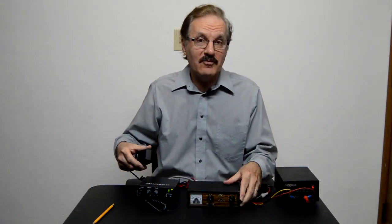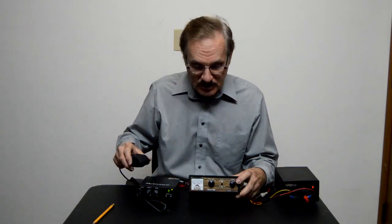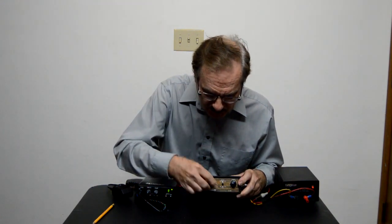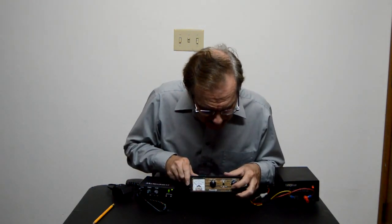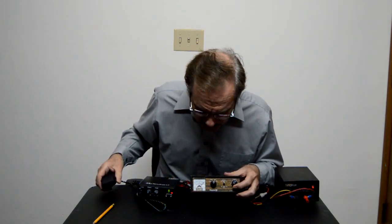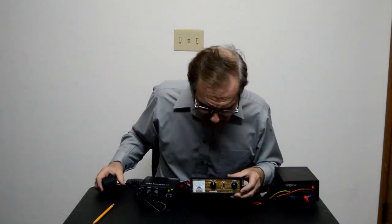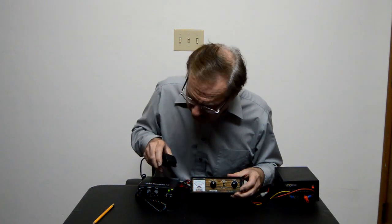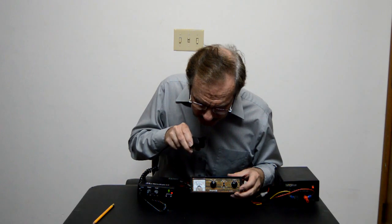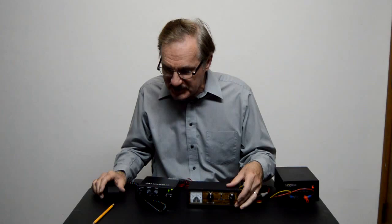But we don't know if we have modulation. You can have power and still not have modulation. So we need to switch this to modulation — you see right there it says modulation. Then you have to set the modulator; watch the needle. We're going to set that right to the end, and then we push it down and check and see if we have modulation. Audio. There we go — we do have modulation. And that's pretty much how you test the CB radio.